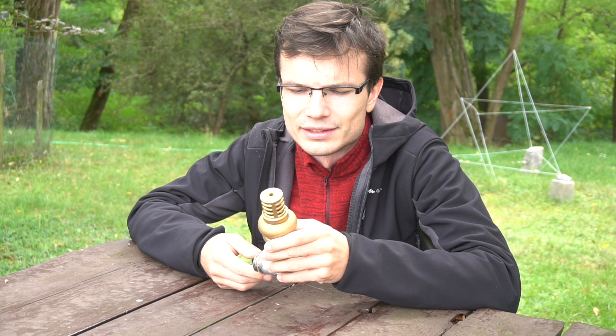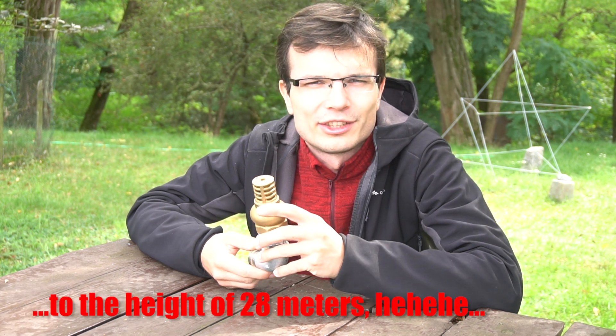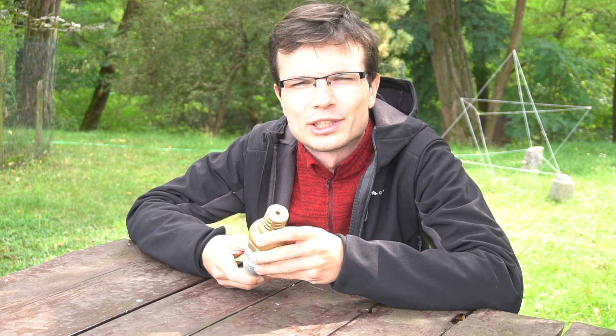With this valve it is better. It's bigger so there is more water going through the valve and the plug initiates later so we can build up more pressure. We can pump the water to 30 meters — that's much better. And also the water flow is much higher than with a swing check valve.